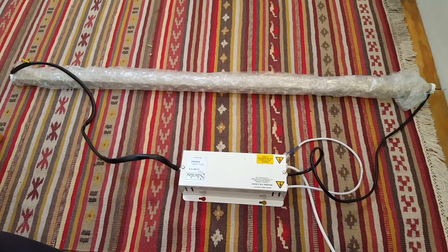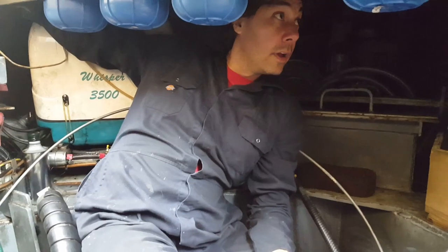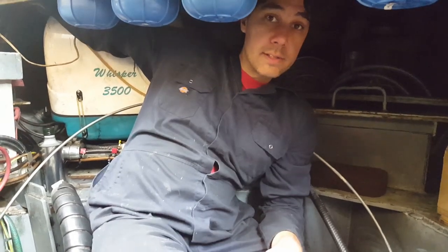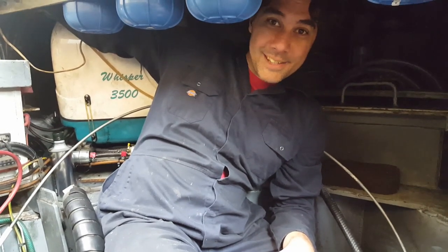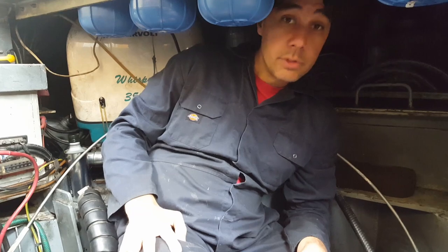All I need to do now is put this into the engine room and connect it to the bulb which is already in situ, and we're good to go. I've wired up and connected the UV filter with the bulb in situ to the electrical supply. I just need to flick the switch to see if the bulb will start. If it does, I'm going to disconnect one end to simulate the bulb not working, just to make sure the alarm is still working. The bulb's working and as it was powering up, in between power on and power off, the alarm was working — so we know both are working. I can see the bulb's on by the blue glow at the end. That's brilliant.